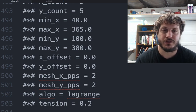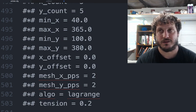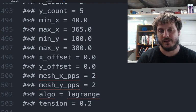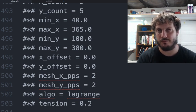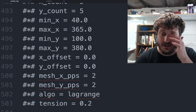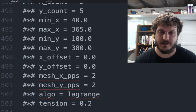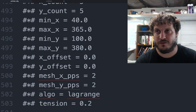One thing that was introduced that I have not had time to do is set up separate configuration files. So you can have a configuration file that's the master file, and you just have some stuff in there, and then you have child configuration files, which might be for your steppers. There might be another one for anything that's bed probe or probe related. I'm going to definitely have another one that's just the macros. I'll have another one that's just the menu items. And that's just a best practice to break it out that way, and then refer to them. So I still have to do that. It's not hard. You just move it out of the file and include that file. But look for that coming soon.